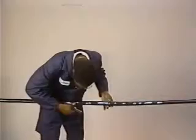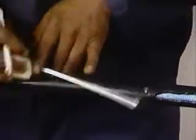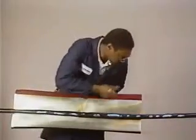First, prepare the cable sheath opening using the procedures already demonstrated. Next, mark the cable six inches outboard on each side of the repair area. Hold the first sleeve over the repair area with one edge on the first mark. Mark the edge at the other end of the sleeve where an overlap will occur. Take the overlapping sheet from the kit. Position it with the glossy side toward the cable. Wrap it one and one half laps around the repair area at the overlap mark, and cut the sheet to size with snips. Unwrap the overlapping sheet, wipe it clean, then abrade it with the supplied abrasive square, moving perpendicularly to the cut end.